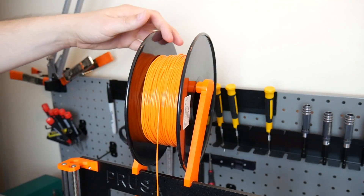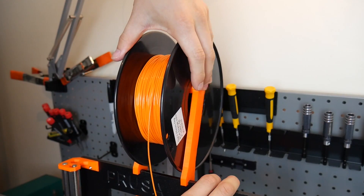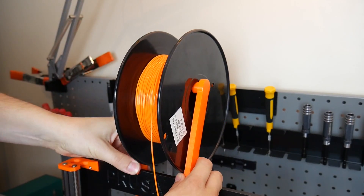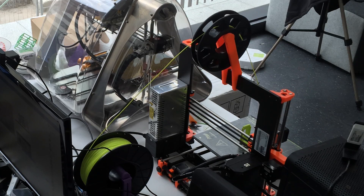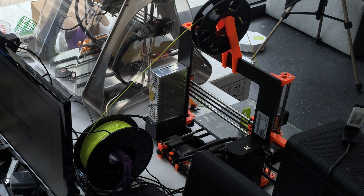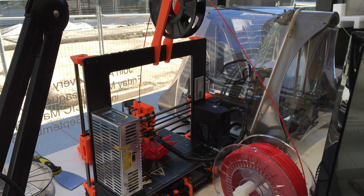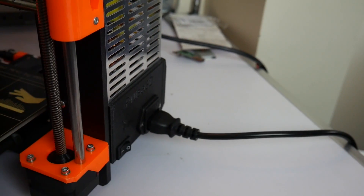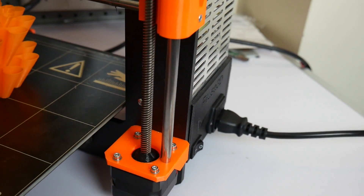Another detail I feel is a little slapdash is the spool holder — not really a big deal, but it only works with some brands of filament, with non-standard rolls not being held and some rubbing on the frame. I also found that through constant sliding back and forth, they've started to bow slightly unless set just right. For most of my printing, I now run a tiny empty spool as a pulley with a 3D printed spool holder behind the machine or on a table, which works really well and takes some mass off the gantry. Rounding up the hardware side is the power supply — thank you, Joseph, for enclosing this safely. There are way too many printers on the market, kits or otherwise, with exposed mains wiring. The 3D printed cover goes a long way to preventing accidents, and it's very much appreciated.